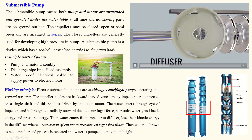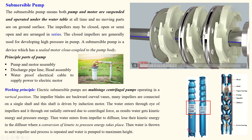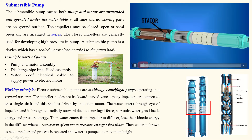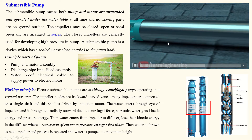Water enters through small openings into the impeller and kinetic energy is created due to the backward curve. The water moves with high velocity to the diffuser. The diffuser converts this high kinetic energy into pressure energy. The diffuser then throws the water to the next impeller with the same high head. Multiple impellers connected with diffusers increase pressure stage by stage so that water reaches the target height. The motor is lubricated with water to maintain constant temperature, preventing overheating.